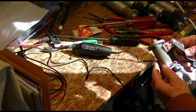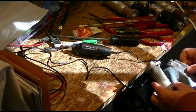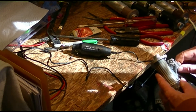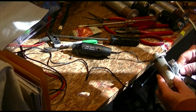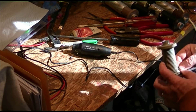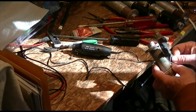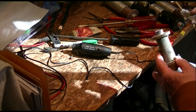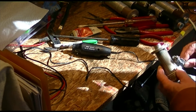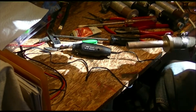This aluminum oxide and any kind of crystalline structure like that can cause TVI. If you know about diode frequency multipliers, which they used to use in VHF, and you go back to the old Galena crystal days, you realize that this kind of corrosion and crap is not your friend in terms of generating harmonics. So you really don't want it.